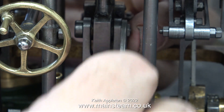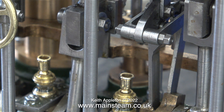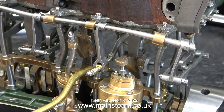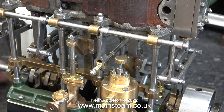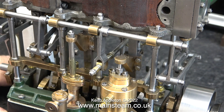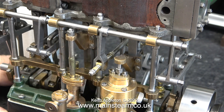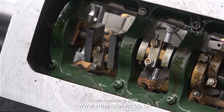Finally I'm fitting the front connecting rod and here it has been bolted into position. The good news is, as I've removed the operating arm for the air pump, I can still rotate the engine. Time for a quick high speed oiling session of the moving parts, then I connect my electric drill to the crankshaft. Initially I'm rotating the parts very slowly and I've just noticed that all the securing bolts are not fitted to the cylinder block so this is going to move around slightly.